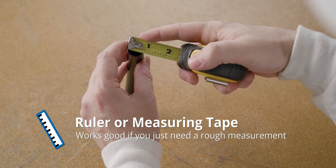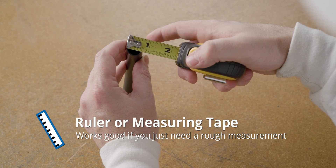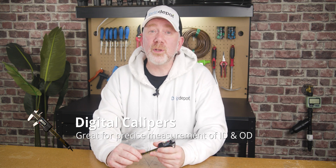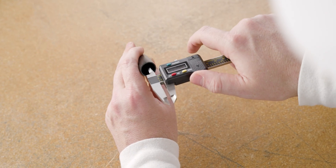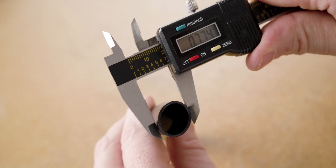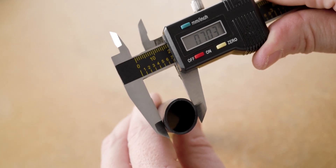You can measure both the inside and outside diameter of your tubing with measuring tape, but it will not be as precise as it would with something like digital calipers. Digital calipers like these are inexpensive and readily available. To measure the inside diameter of the tubing, I'm going to use the inside caliper right here. You'll notice tubing is not necessarily perfectly round, so you might need to take your measurement in a couple different places and get an average or overall idea. To measure the outside diameter, we just use the outside caliper — simply open them wide and close them until they come in contact with the tubing. As you can see, we got 0.703, close enough to identify it as 0.700 outside diameter tubing.